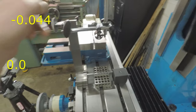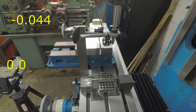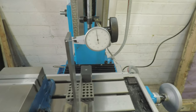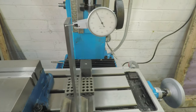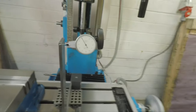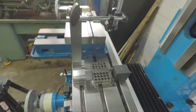Measuring from the bottom to the top is 44, so that's a deviation of 8 in the measurements. Considering that when you push on the head you can actually move the head about 30 microns, that's pretty good.